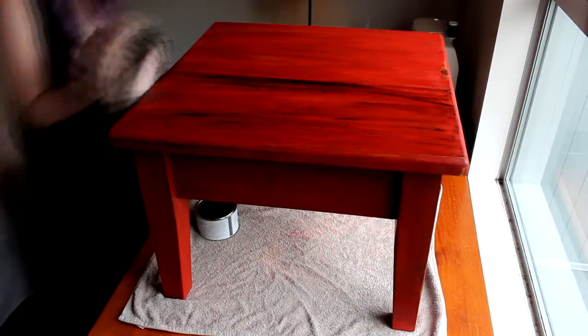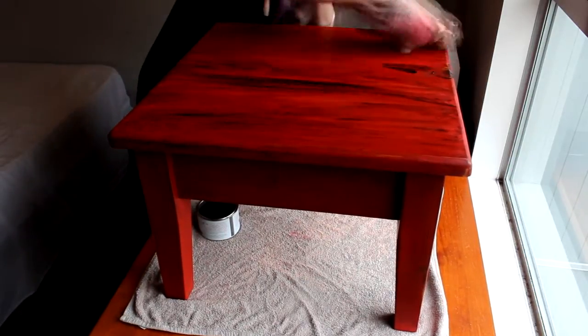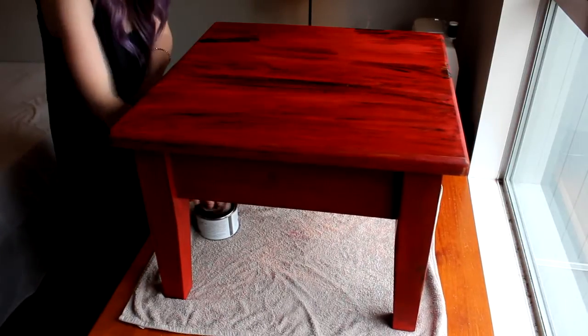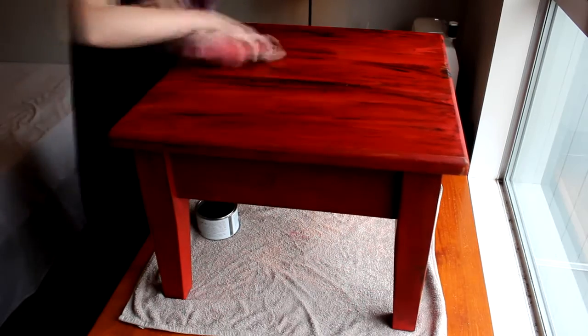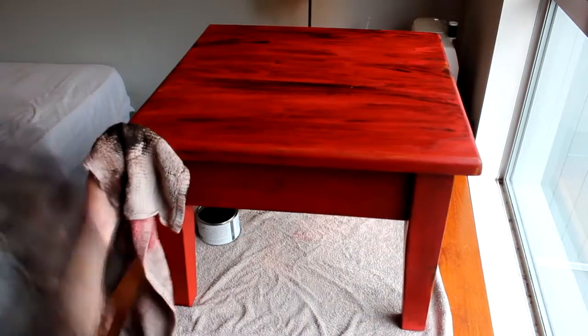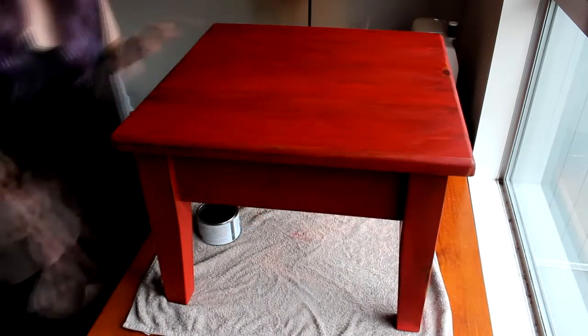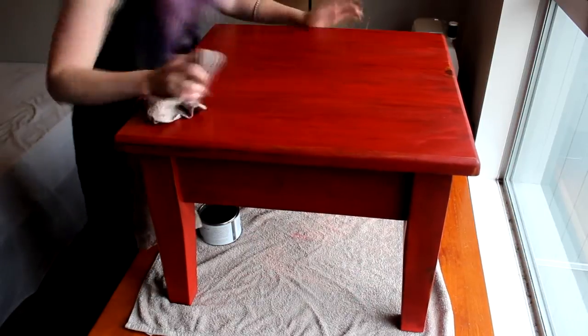Now we are moving on to the dark wax. This is the first time, yet again, I've used any of this product. People seem to be really afraid of the dark wax, but I wanted it to have that real aged look. As long as you follow the grain of the wood and go in a back and forth motion as opposed to circles — because circles don't look naturally aged, like when you see a car that's been buffed and it's got all the circles and it just looks wrong — you just need to follow the grain of the wood. Anywhere you want it darker, just slap on some extra dark wax. The lady at the store said you need to have the clear wax first; you can't just do the dark wax or it'll look muddy. I was trying to explain to her that I wanted it dirty looking, but I ended up with the clear and the dark wax.